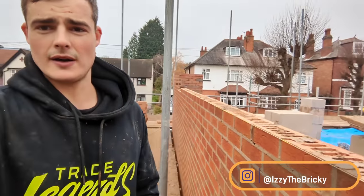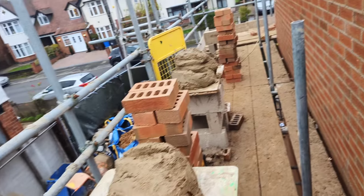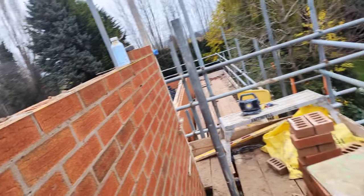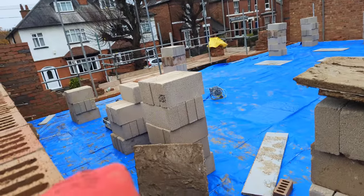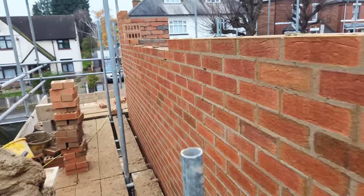Morning — we are back on the job. So far this morning I've loaded out an extra 200 or so bricks. Just need to point up the brickwork from yesterday; it's still pretty green, which is really decent. Thrown out a load of mixers. Once we've blasted this panel up, we're going to hop on the inside and do all my cuts for the beam fill. Plenty to be getting on with. Drew isn't here again, so just another day of working hard.